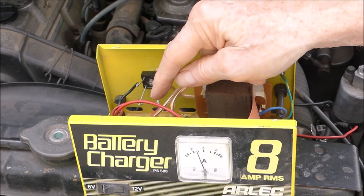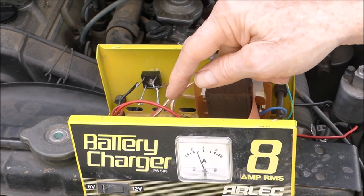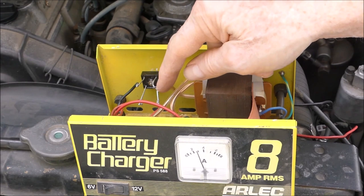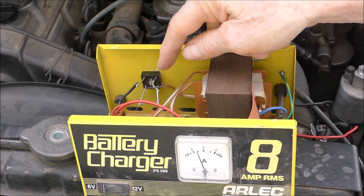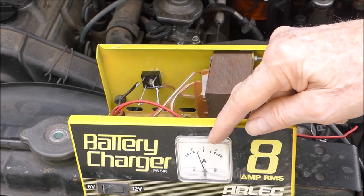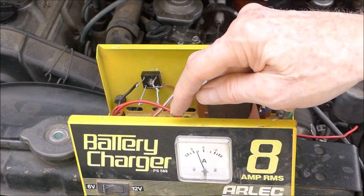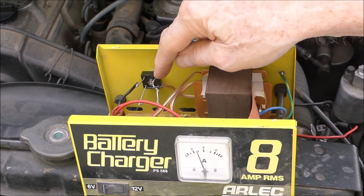You don't really need it unless you dead short these things. In all the years I've used battery chargers, I've never ever blown a fuse or shorted one out, so it's up to the user — if you're careful, it'll work alright. Those are the basic components in the thing. The amp meter can be dodgy too, so you want to make sure you check you've got continuity through the amp meter. And yeah, we'll deal with the bridge rectifier.